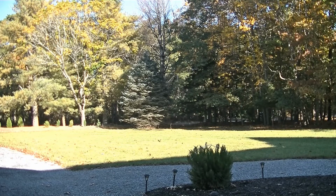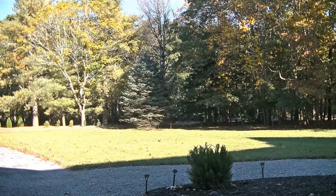And that's exactly what you want to see. You don't want to see any more streams of water. A light mist is okay. As long as you get most of the water out of the lines, even if the lines do freeze, there's enough room for the water to expand without damaging the lines. So we're going to call that good.